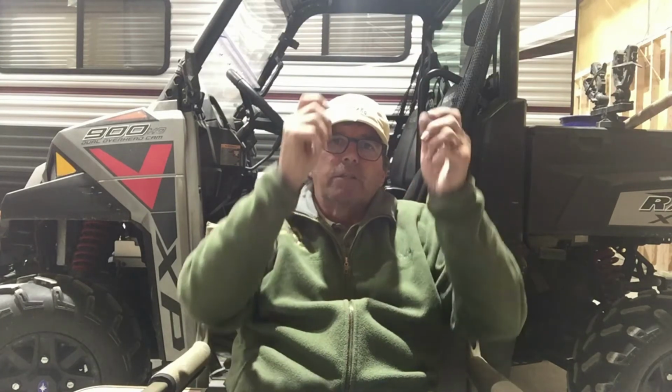When I got done, after we had it mounted and everything, I was able to go up there and take a level and try to figure out where it was in between those 2 ribs, and I could take those chains and move the whole unit over. So you can move the whole unit over 3 or 4 or 5 inches, since it's hung from a chain from the strapping, which had the holes in it.